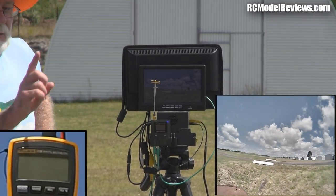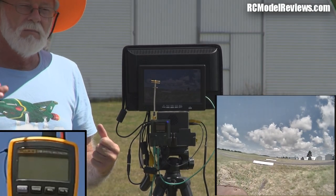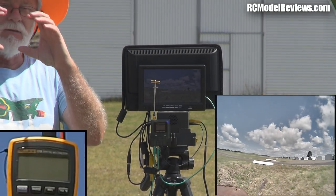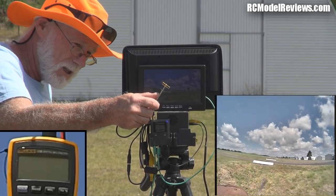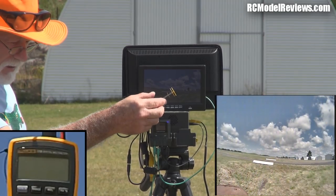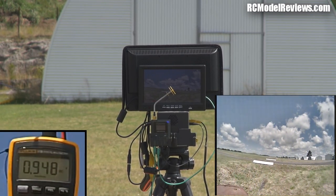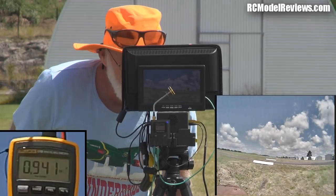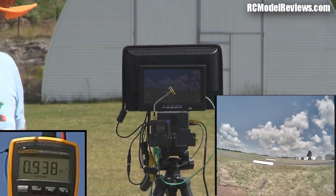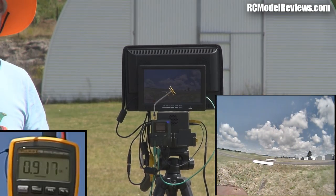Now here comes the real test. I'm going to tip this Pagoda antenna over and see how big the hole is at the top, because it's getting the gain from somewhere. The torus shape is actually a bit flatter and has a bigger hole in the top. At 45 degrees, the RSSI has dropped down to 0.93, which is a bigger drop in percentage terms than we had with the Triumph. It does reinforce that this antenna has a bigger hole in the top — that's where it gets its gain from. So there's a superior axial ratio, but the Triumph performs pretty well.